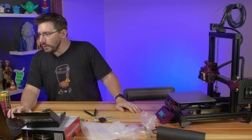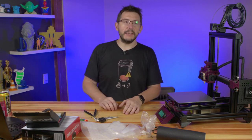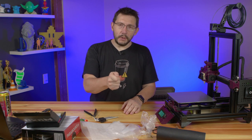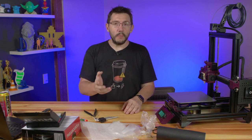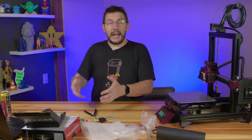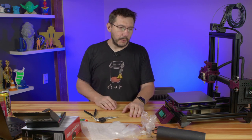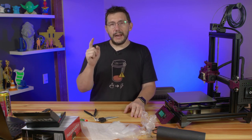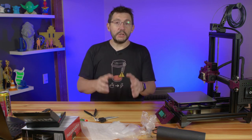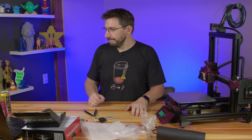What'd I miss? Jordan McClintock, $5. I'm still waiting on my CR6 SE to be delivered. It'll be my first printer, since you've had yours a while. What do you think of it? And did I choose well? My CR6 SE died. I plugged a USB cord into the USB port, and as I was doing that, there was an electrical spark. Naomi Wu asked if it was a static spark or an electrical spark. I said it was not a static spark. And in fact, I've confirmed that the board is dead. I've talked to Creality. They have a solution. They're sending me a board and I have to make an update video for you. So just know, when you get your CR6 SE, if there's problems with it, talk to Creality immediately so they can get you a new board. There we go.